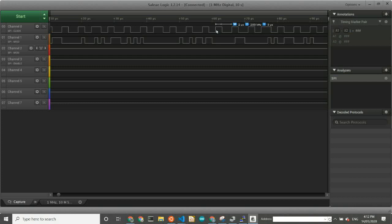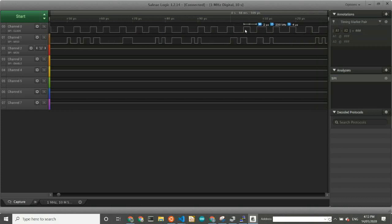One of the caveats for using this is you cannot have the energy monitor connected to the SPI bus during the host booting, because it uses the same SPI bus to read its ROM. So if you have something else, you have to explicitly have it on high impedance and then turn it on via some GPIO and put it on the SPI bus. If you have it plugged in during boot, the host will not boot. So that's what an SPI bus transaction looks like. It's just reading stuff, and there's a clock.